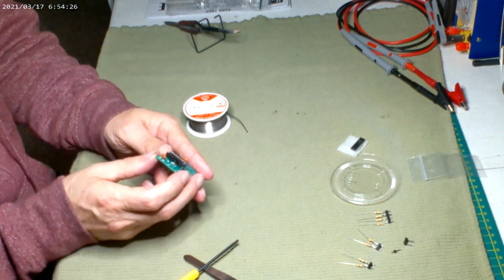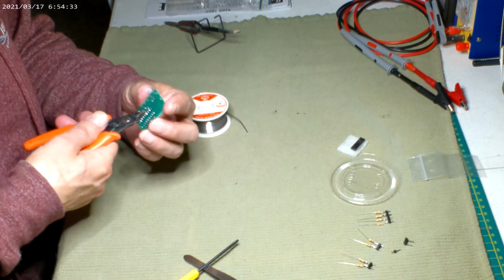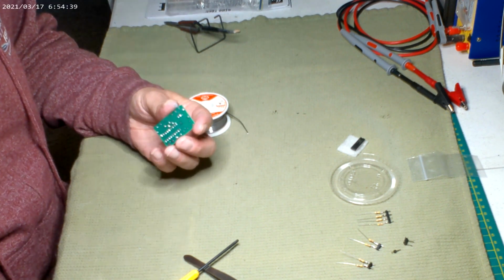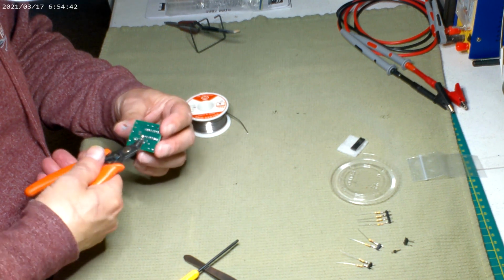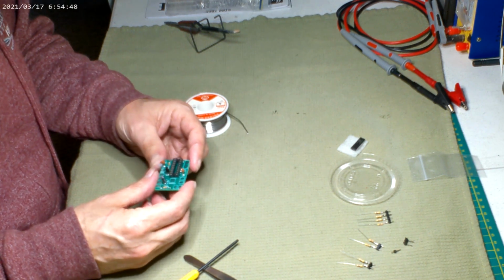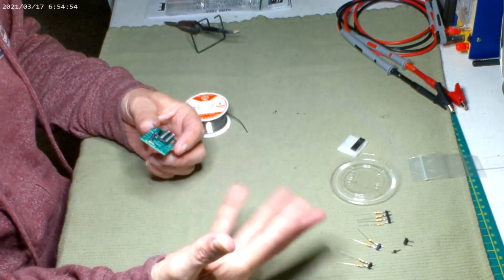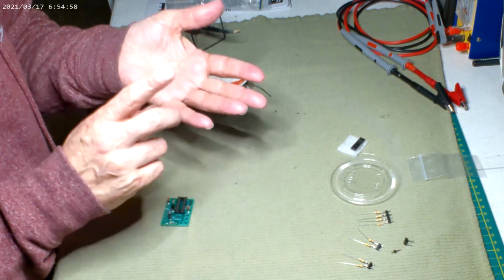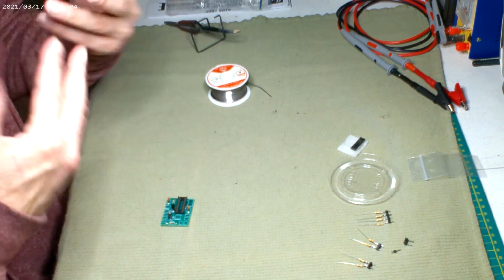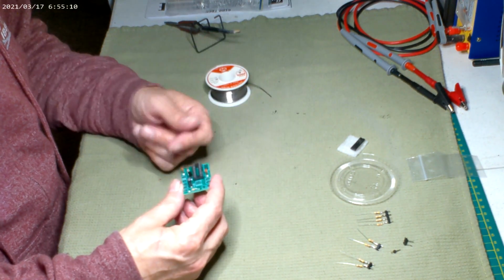Sure looks like I knew what I was doing. Getting better at the soldering. I did a lot because I was an audio engineer, so I helped fix consoles. We did a whole automation upgrade to an old Harrison console. So I had to solder, I don't know, a ridiculous amount of points. Because in the audio world, you're running balanced signals, so you've got a plus and minus and a ground, a shield. So one connection usually deals with one signal wire and a line can deal with three wires for your high, low, and ground.